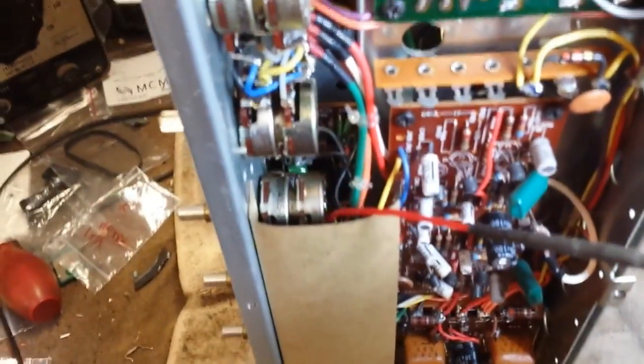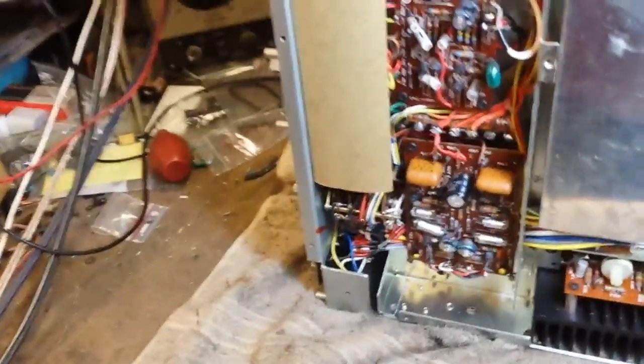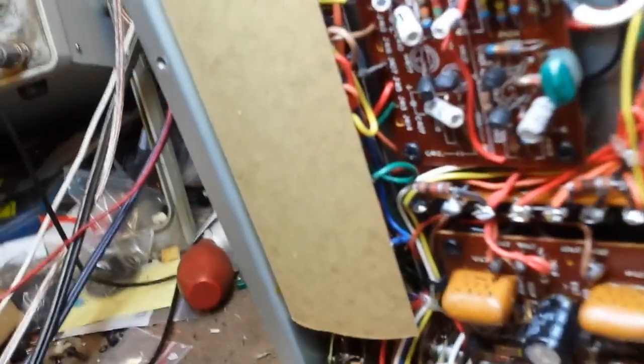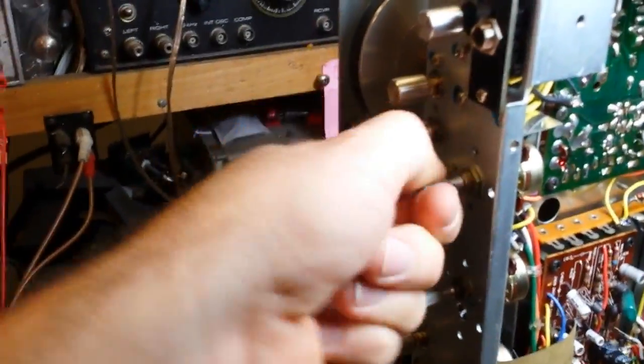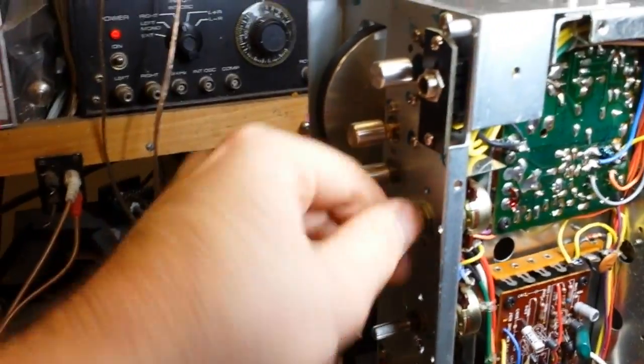You want to get down here into your tone control for your treble. It's going to be hard to get to the mid-range one without pulling it out, but you can — that's what the long straw is for. We're just going to fish it in back here. Before we do the rest, you just turn these back and forth about 50 or 60 times to clean them up. I'm going to do all the pots, and then I'll show you how to do the switches.